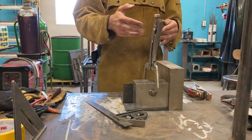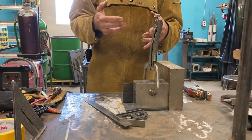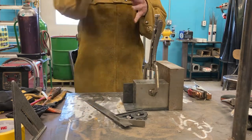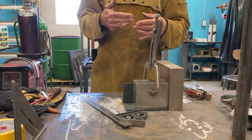So if you have a big magnet near where you're welding, you're gonna see some very strange things happening, and very often students forget this. So they'll have magnets holding everything together, then when they strike the arc, it suddenly goes crazy. That's what we call arc blow. So I think one of the modules has a video on arc blow that I think I posted already.